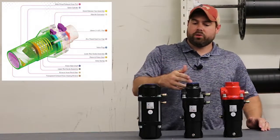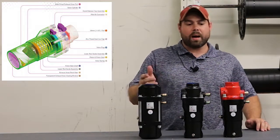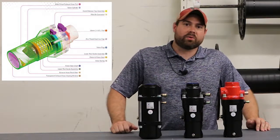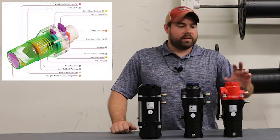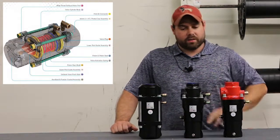The Combi 1 and the Combi 2 both have the inch and a quarter, which is fairly standard for your air out going to the pot. Whereas the Combi 3 is the XL, or big gun, or high performance as they like to call them, and it's got an inch and a half. So your air in is inch and a half, air out is inch and a half.